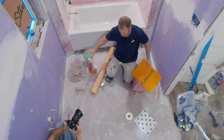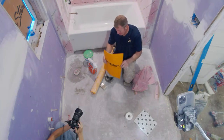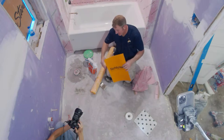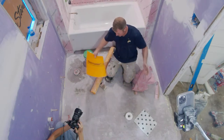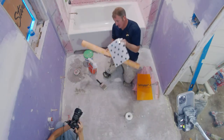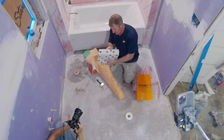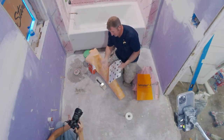All right. Okay, so when it comes to waterproofing, there are a lot of different systems out there. This is probably one of the most popular. You've probably seen me install hundreds of feet of this online, on how to go about installing Ditra. It's a great product, and I find it to be best for larger tiles, so 12 by 24s, plank tile, anything with that larger size, because in order to waterproof this, you need to have a band that goes over the seams. Most of these products are only about 3 foot wide, so you're going to have a seam somewhere within the bathroom that you have to address to make it waterproof. And that seam is problematic for smaller tiles like this. Any little bit of a deviation or hump is going to allow this to raise up, and these things are not very easy to float thin set under. If you make it a little bit thicker, you're going to be fighting the thin set that's going to come out of the joints.